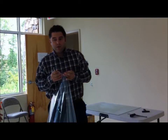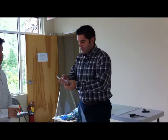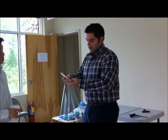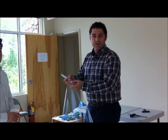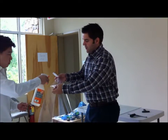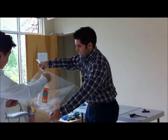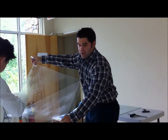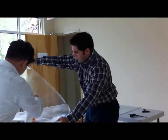You can see that the scotch tape pulls the two pieces apart. One side is smooth and the other side is a little sticky. That sticky side is what's going to be applied face down onto the window. As you pull this away, you're going to want to spray it — what this does is it takes out any static electricity that may otherwise pull any type of particle to the window.